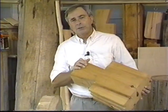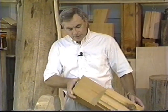And before you consider putting a chainsaw guide on your present saw, you might want to consider looking into the other options of other saws, lengths of bar, power of the saw, and so forth, because if you're going to be cutting material that's this big, you may want to consider a different size saw than you might have if you were going to be cutting something smaller like this dovetail on this 6x12. So that's the first thing you want to consider. You want to consider your chainsaw size.